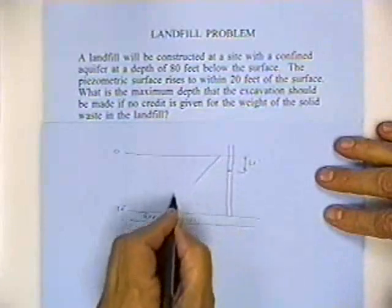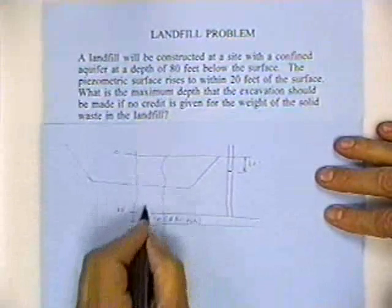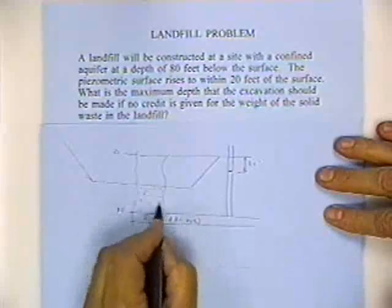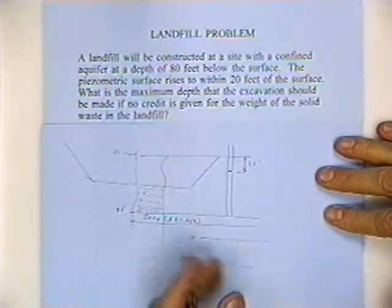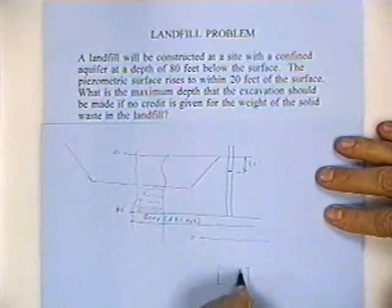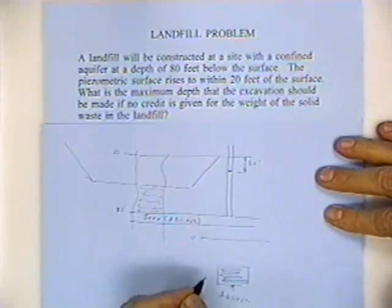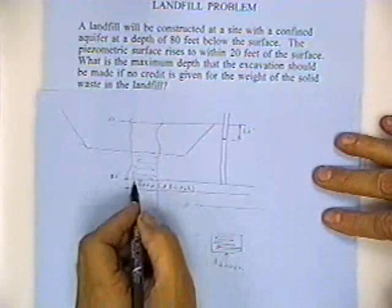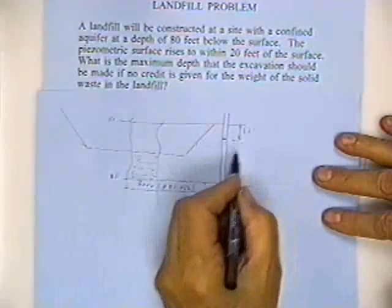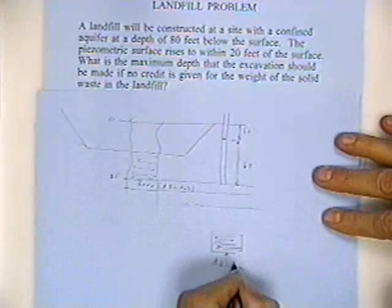I'm going to come in here and I'm going to dig a hole. Big old hole. And I'm just going to pick this element of the soil right here. So what I've got is this soil mass right here. I've got the original surface at zero. I'm going to dig the hole, and before I put garbage in it, I've got water pressure acting up against this block of soil. So here's this block of soil, and here's my aquifer. And I've got pressure pushing up against that soil. Well, I'm going to express the pressure as potential energy, as feet of head. How many feet of head do I have pushing up against the bottom of this? If this is 20 feet, this is 80 feet, what is that dimension? It's 60 feet. So I've got 60 feet of head